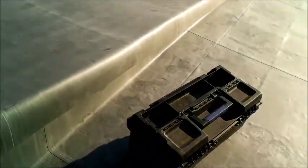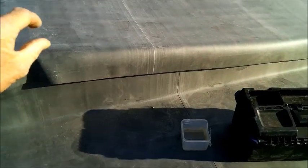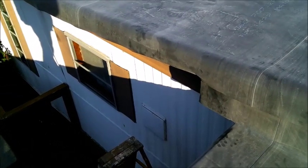Looks good. And then we'll have termination bar here, and this box that we built right over here, we close that in like that. The rubber will wrap around that, and there'll be a piece of metal covering that. Nice piece of metal. So it's looking good. Fascia metal, termination bar, glue that big piece down, be good to go.